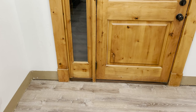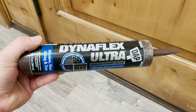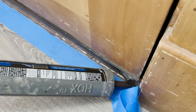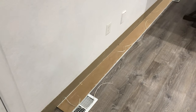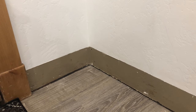We're almost done with the vinyl floor laid out, but there are still a few more important things to do. I need to cover up the gaps between the floor and the wall by putting up the baseboards, but there's also a big gap in front of the door. To fill in this large gap, I'm going to use Dynaflex Ultra Sealant — it's like a mix between caulk and glue and is extremely durable for things like a door or window. Just put it in a caulk gun and run a bead down the edge. Lay some tape and have a rag nearby because this stuff is really hard to get off once dry. This Dynaflex comes in multiple colors so you can match it to the trim of your house. Because the vinyl floor is thinner than the carpet and tile, the baseboards are going to drop about a quarter inch, so I need to clean off any old caulk or paint with a scraper.